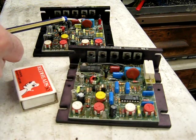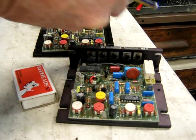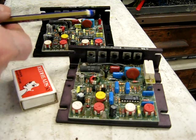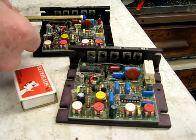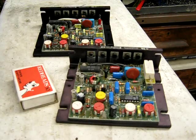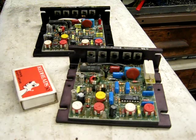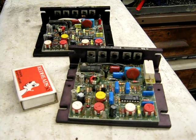The basic units like this don't have any provision for armature switching on the circuit board, so any armature switching would have to be in the DC line going out. That's easily done with a three-pole crossover switch. Like any of these controller boards, you should never change the motor direction with the controller switched on, because the back-EMF from the DC motor can come back and cook the board if the controller is actually running. So turn off the lathe and then you're quite safe to flick the switch once the spindle on the lathe or the mill has stopped turning.